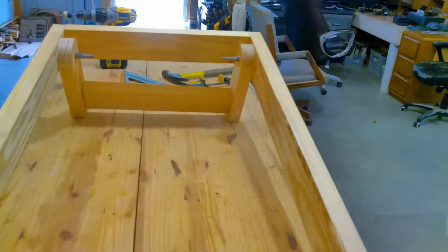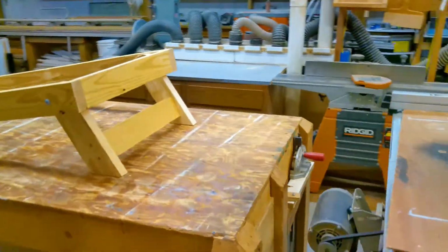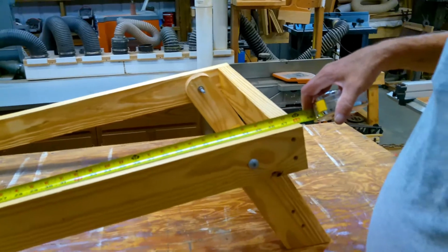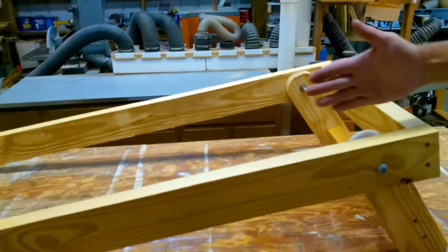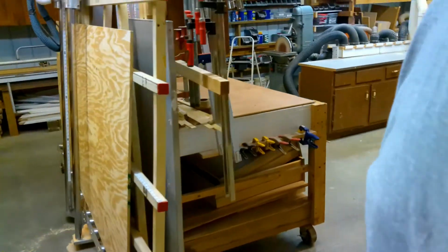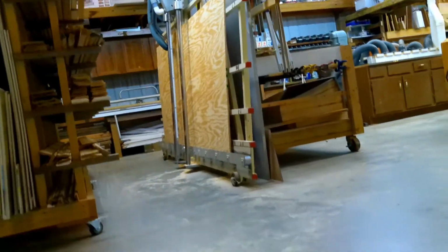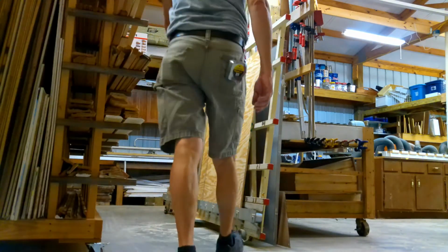All right, we've got the boards installed on that one and the other. And so now we've got to go ahead and cut the plywood. So the first one, of course, these are going to be 48 inches long. So what we're going to do is cut that to make up the 48 inches. And I want the grain on the plywood to go this way when I get done, because it's going to look better. So, I do have this luxury of a saw. Makes cutting sheet goods really easy. So we're going to go ahead and cut this at 48 inches for now, and just cut the length of the sheet. So we're ready to go.